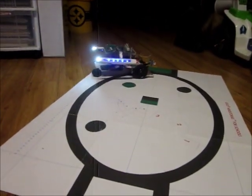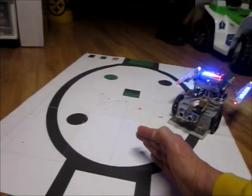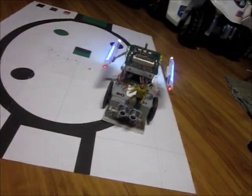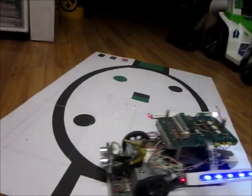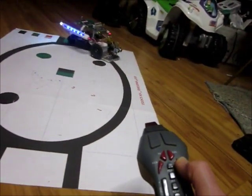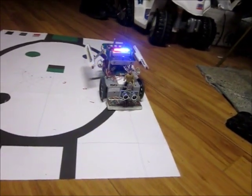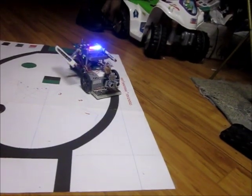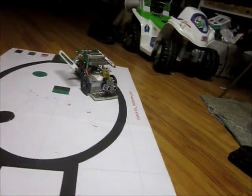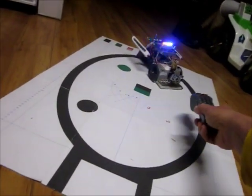It has the ping sensor detecting a signal — that is what the flashes are for, like a siren. If we detect an obstruction, it stops. It goes away, it comes back. Now we're going to see if we can send the remote control signal to it and have it stop. I'm remoting it — there, I hit the pause button at zero speed. Also in this mode, if it detects something with the ping sensor, it's going to try and back away from it automatically, so we don't have to control it so much with the remote control.